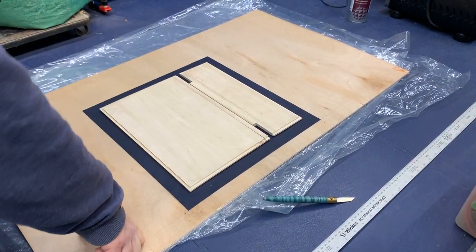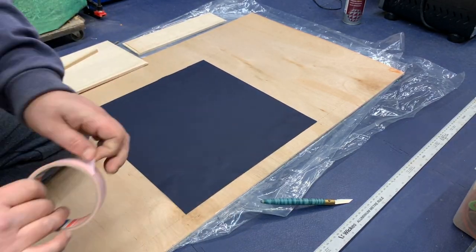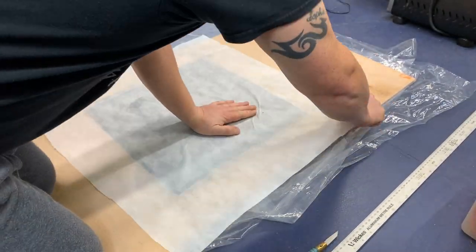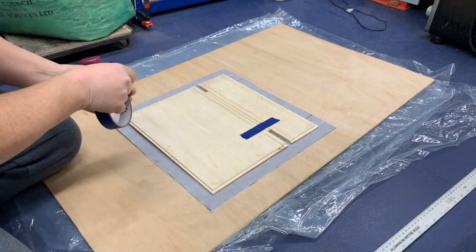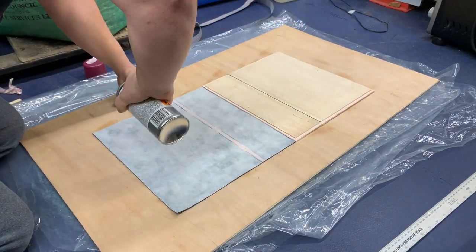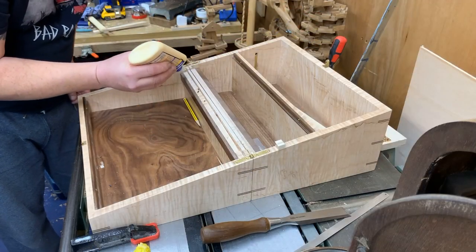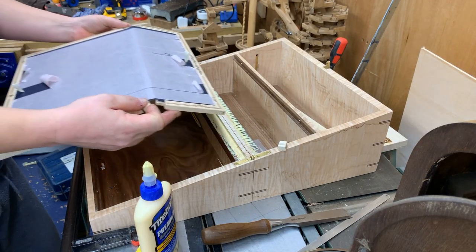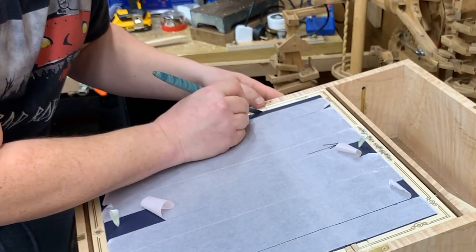This was where I started with the leather. I really haven't had much experience with leather so please forgive my techniques. I started by laying out the top and bottom slope bodies but then realised I needed to tape up because I'm messy. The leather had to act as the hinge for the top and the bottom slopes, so I decided it would be best to give it a backing for a bit of extra strength. I then laid it all out again, cut the leather down to final size, added spray adhesive to the back of both pieces, and went for it. It was only actually being glued in the recesses, not to the carcass itself, which would allow it to flex easily when the box was closed.